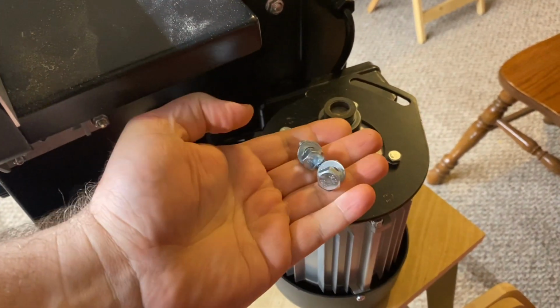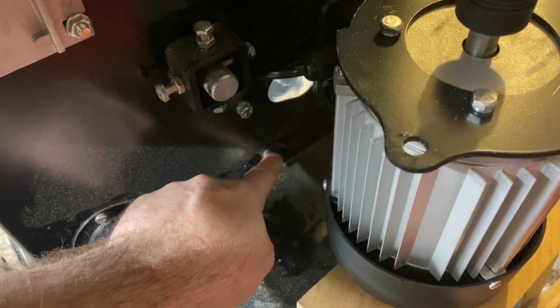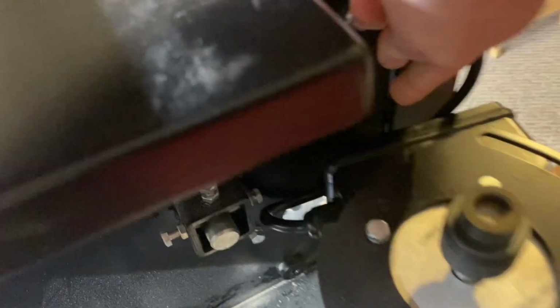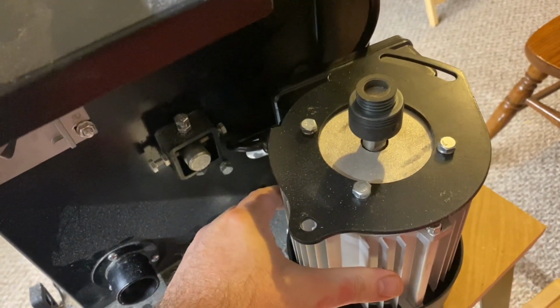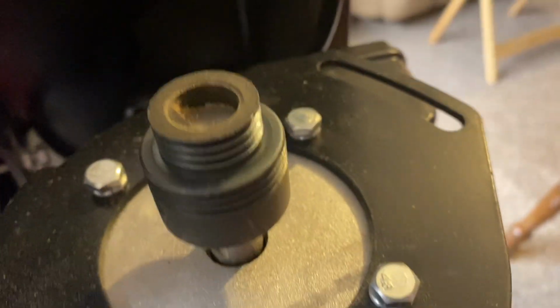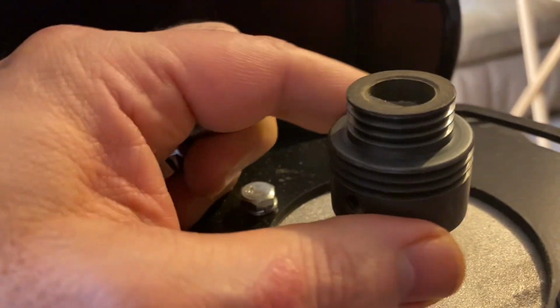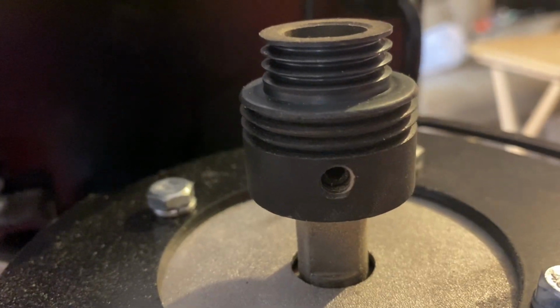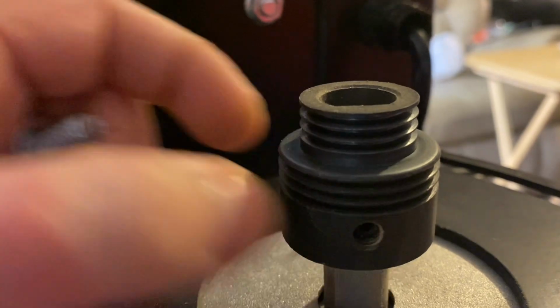Okay, so I've taken out 2 bolts with 1/2-inch heads. One here, which mounted here, and another one through this, which mounted right there. And you can see by this slot that it allowed the position of the motor to be shifted for purposes of tensioning this pulley against the belt. I'll get some shots of the pulley. It has grooves in it that match grooves in the belt, and you can see there appears to be a set screw, grub screw on it in just one place as far as I can tell.